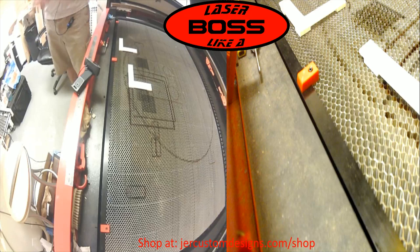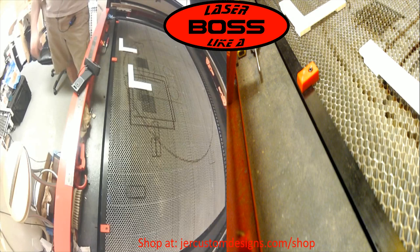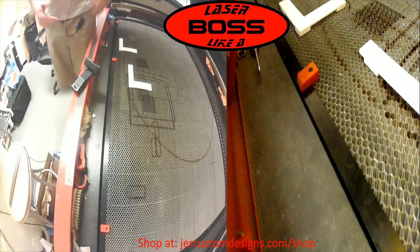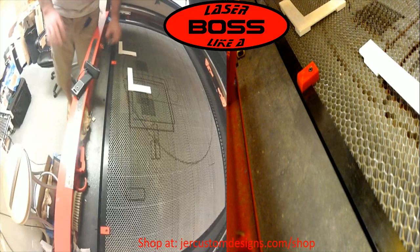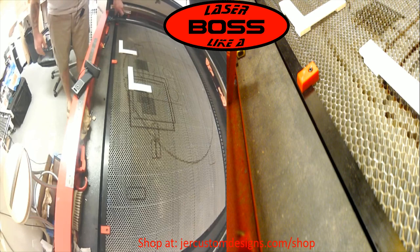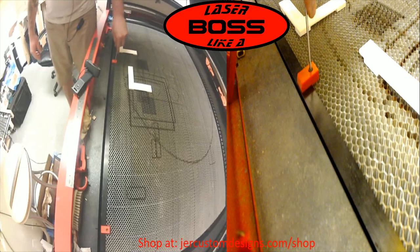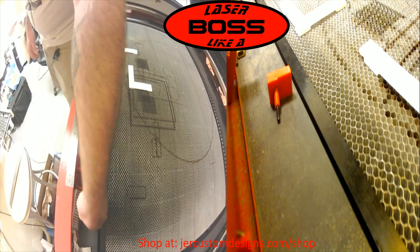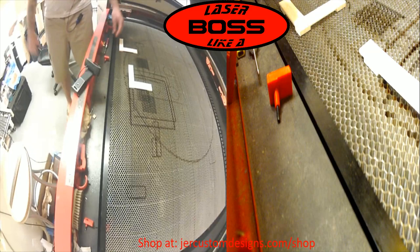I hope to have these ready to go soon. We've got the hurricane coming this way, and depending on how bad it is, may be down for a little bit. I gotta start getting things ready and prepped for that. I'm going to go ahead and disassemble this. We've got three tabs here that hold the top part of the clamp. All you do is a simple 3.5 millimeter Allen head — that takes them out. These are 30 millimeter bolts; 35 millimeter bolts will be coming with the kit. I just had 30 millimeters available and luckily it was just enough to work. Now all the tabs are out — you can see the tabs sitting here.